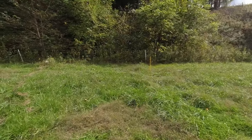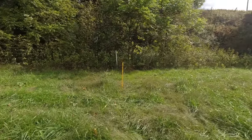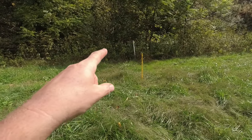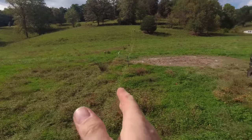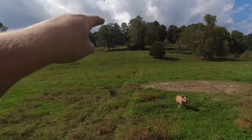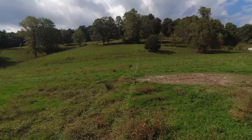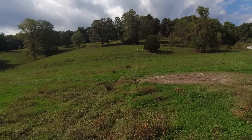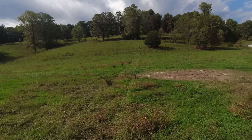All right, we didn't film it because we had too many things to do with all of our hands. So we're putting in just a temporary line with these temporary posts. You can see them going right up the hill towards where Newman is, and then we're going to tie into the barbed wire fence that goes along the road. We'll pull the temporary line down here. The end of that has a non-conductive handle on it, so it will not energize the barbed wire.